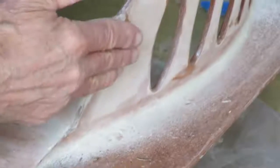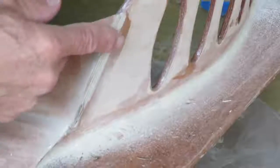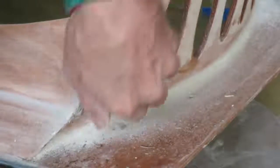One reason for moving up and down the cut as you cut, instead of cutting all the way through at one point, is you probably minimize the burning that way. You keep from getting one area too hot by moving down to cut into another area and then moving back and cutting through the first area. And we do have our fillet back behind that piece. See, there's an overlap.